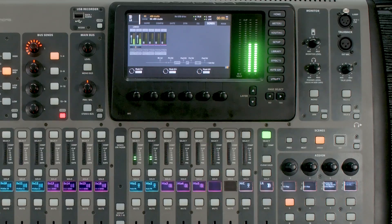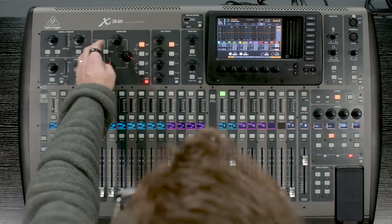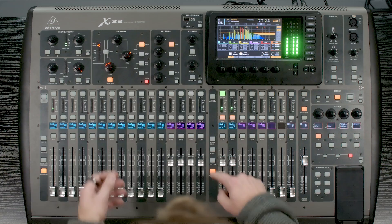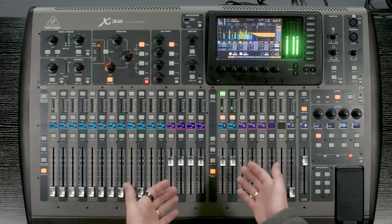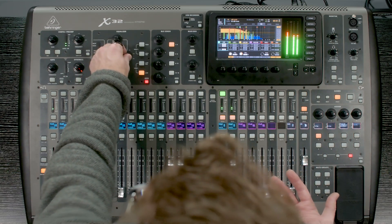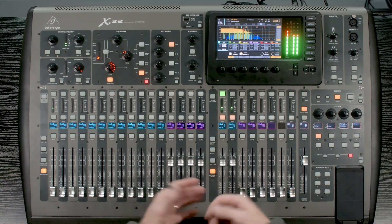Let's press play. We can see metering here and metering there. Now, if my PA is too bright and I need to adjust that EQ, I can select my matrix section, go to my EQ, turn it on, and utilize it to make the sound darker. If I solo matrix one and two we notice it is a little darker. Here is my main left-right, and here is my matrix feed with the EQ adjustment. If it doesn't have enough bass and you want it more bassy, you can go the other direction — this is just for demonstration purposes.